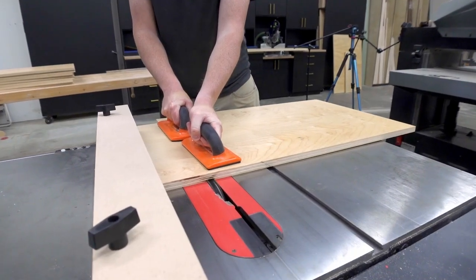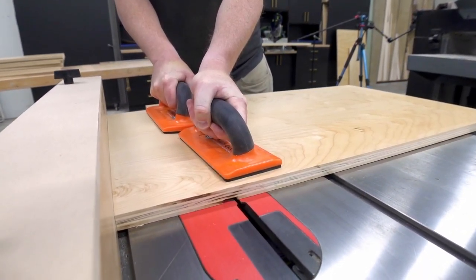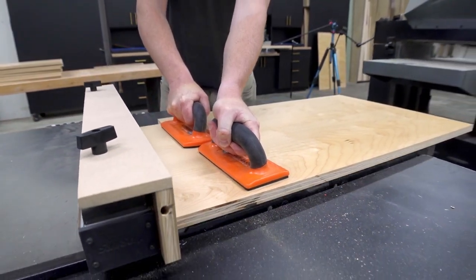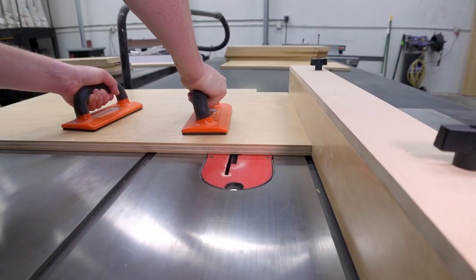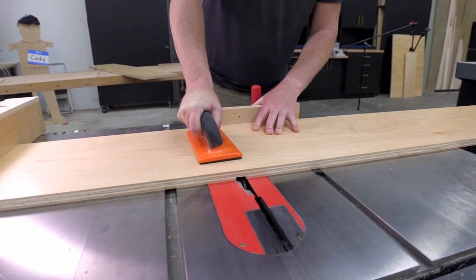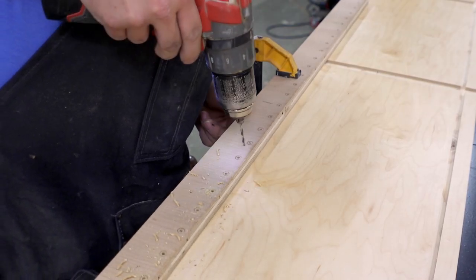So before I had Cody do any of these dado cuts, we had an entire day of safety training. But more importantly, I told him how these dado cuts can really bust your balls. Oh, I mean literally. I confidently told him that running dados like this, I have accidentally gotten kickback right in my nads 3 times before. Let's just say I don't have children. So hold on tight and never let go of the panel. Talk about nuance.